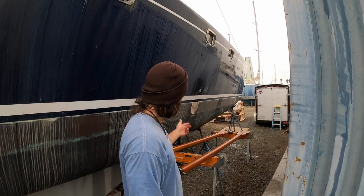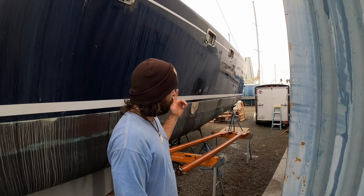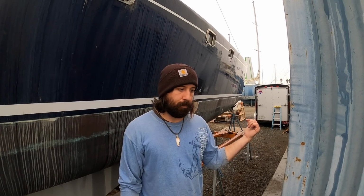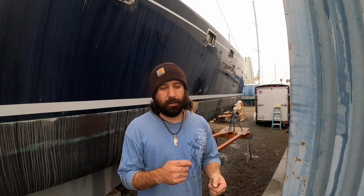Okay, so the collar's done, except for just a little coat of paint, but we'll do that back at the boat when it's not wet outside. So next I'm going to probably drill and install the eye bolt that needs to go at the base of the boom. And then I've got one to install on the gaff, as well as a little pad eye to lace the end of the gaff up to.